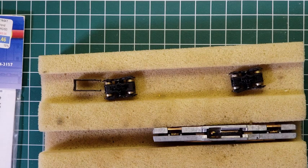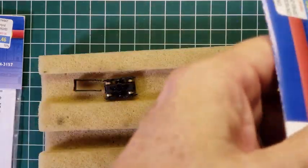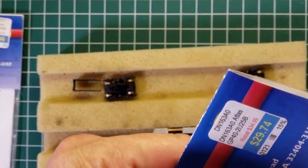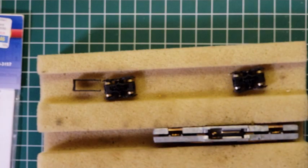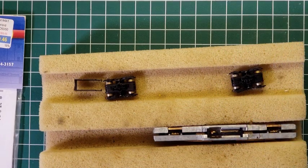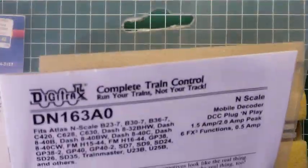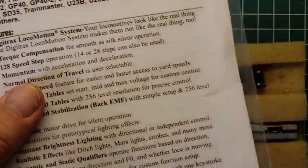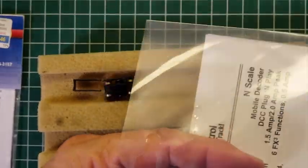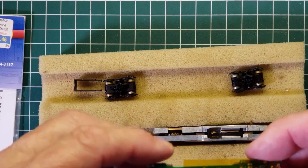So you'll see this in a lot of motor controls. Pulse width modulation, PWM, and when I'm doing a video, I may even put some pictures in the description here, or down at the bottom. But we're going to use the Digitrax one. If you're doing very slow speeds, the TCS does have an advantage at slow speeds, and they run cooler. Most people don't do switching and whatnot, especially with these larger engines.